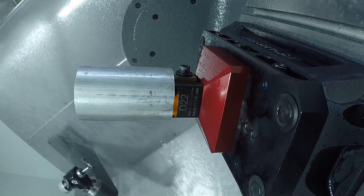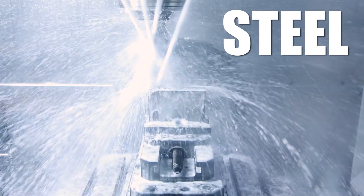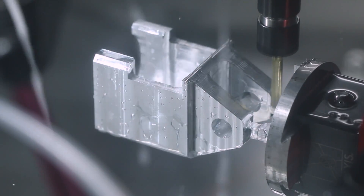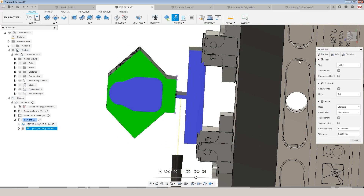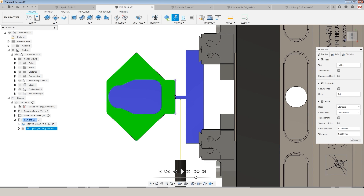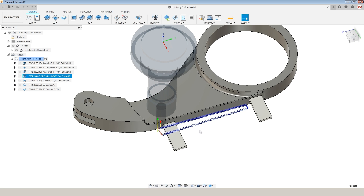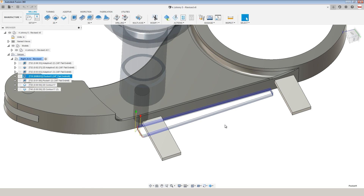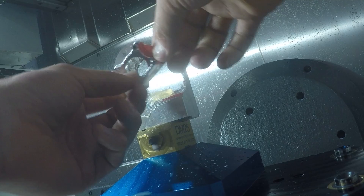The last two videos focus mostly on five axis work holding. The first was a video on how and why to use dovetail fixturing — tips and tricks, programming workflows, raw material workflows, how to make or buy dovetailed material — and we walked through a number of really good fixturing examples where we've seen dovetail fixtures in use. Finally, a video dedicated to tabbing off and finishing strategies on five axis workflows. Starting with thicker tabs, very useful when there's already going to be a secondary operation where you can machine away that thicker tab. Moving on to thinner tabs, doing multiple tabs along the same plane, and then improving that with multiple tabs along different planes. Wrapping up with window machining tips including leaving small tabs or using hot glue to pot the part in place and finish machining every single surface in a single setup with no downstream post-processing or deburring required.